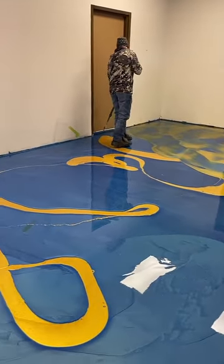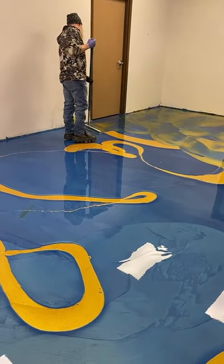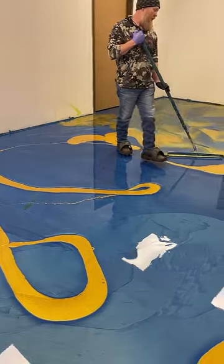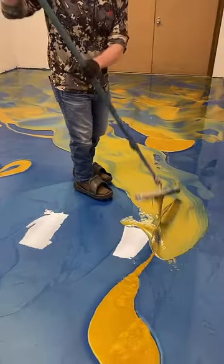And I'm not worried about T-bar marks right now because I'm spraying a lot of alcohol. And this is a metallic, so it'll hide a lot of that. If I was not spraying heavy alcohol, I'd be getting really careful right now with how many stripes and how I left the stripes and what they look like.